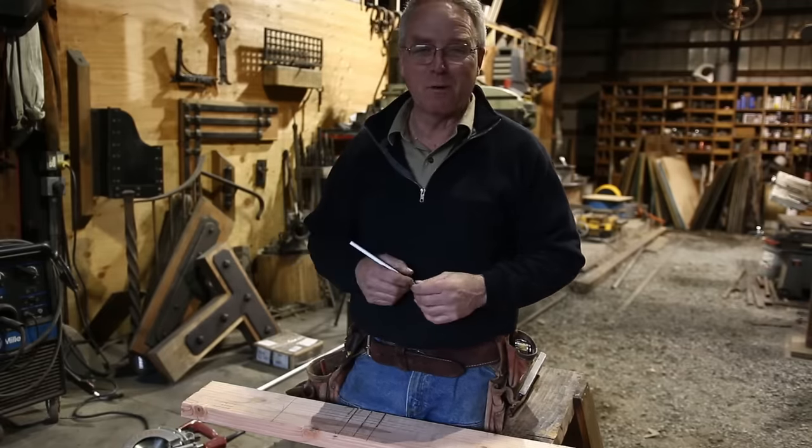Let me make up a number and say within 2 or 3 thousandths. Sometimes that's a tolerance you have to work to as a carpenter. So with expensive material in an interior finish condition, when a fine line is important, you can use a mechanical pencil. The lead's not going to break on a surface like this. A lot of guys that I've watched do this work, and I've used it a time or two myself, use an X-Acto knife. You can always get a sharp edge. It's angled out there. This utility knife's been beat up with roofing and everything else. But for a tight, tight tolerance line in a very exact spot that's going to relieve the grain a little so it has no tendency to splinter as the cut is made, use a razor. It's a perfect line.